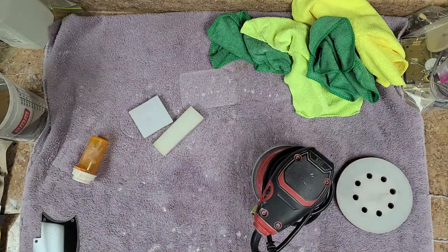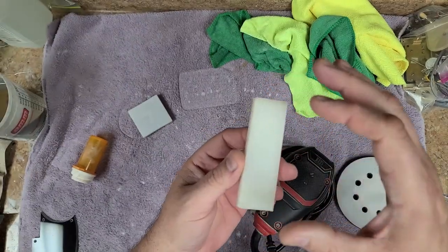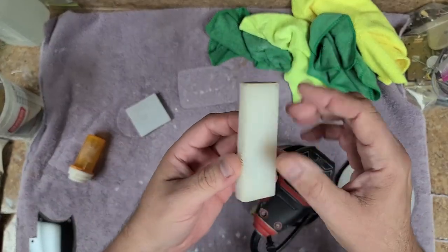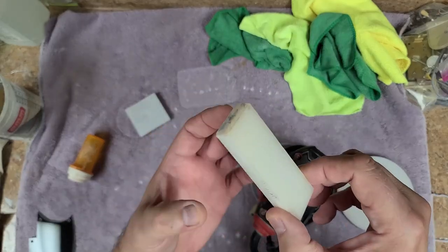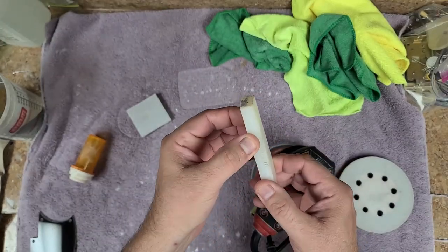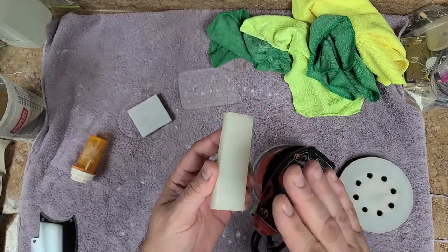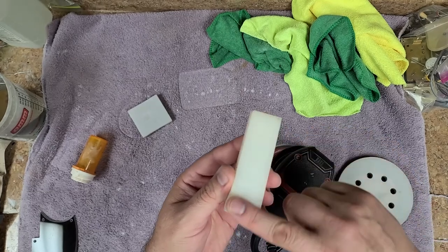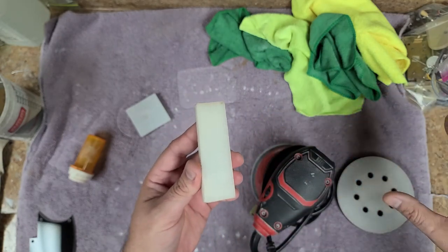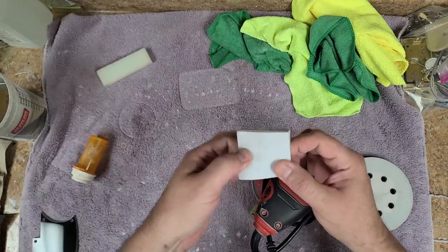Here's another plastic block that is completely flat. I can use it for either wet or dry sanding. For dry sanding, I put a peel-and-stick paper on it, usually 220 or 320 grit roll, cut a piece to fit. For wet sanding, I wrap the paper around it and hold it on both sides using the grip area. The key is making sure the block face is clean with no debris between the paper and block, because anything there will transfer into your finish or leave a line in the wood.